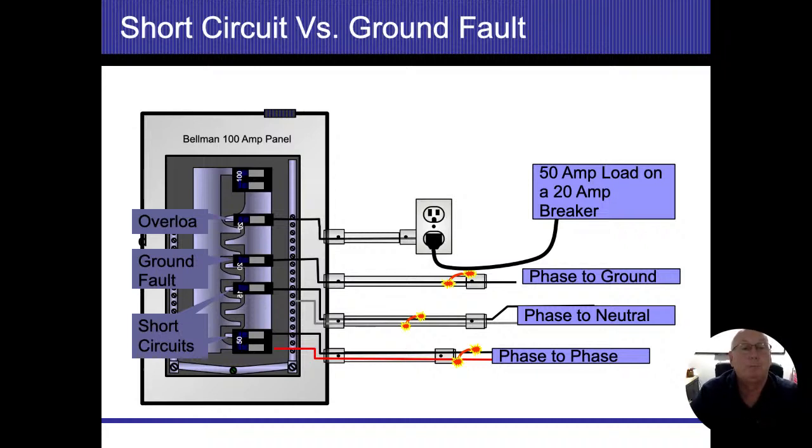On the bottom, there's a bar that connects my two neutral bus bars, and you'll see a green screw in there. All right. So on the bottom, that green screw actually goes right into the neutral bus bars where that metal's connected to it. It goes through the gray or black plastic insulation. The insulator is the black plastic so that it separates my ground, my neutrals, and my energized conductors and my bus bars. It keeps all those separated. And then it keeps going through that all the way into the back of the panel, so it screws into the panel.